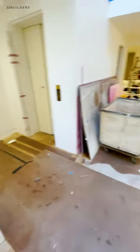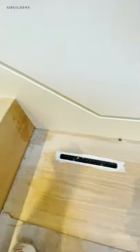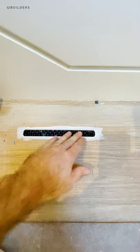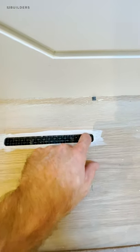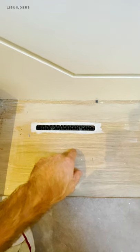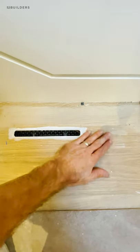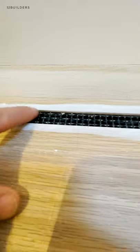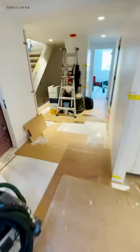Down on the first floor, we're going to do this area last, actually next week. We have these HVAC vents. If you guys remember way back when we did a site visit on it, these are actually metal grills, almost like automotive grills. We epoxied each and every board before the floor went in. This is the easy way where it's going with the grain. Tung's already white-stained these areas, so when he goes over with his buffer and stains the whole top, that leading edge — just a little eighth inch — is already done. This one here is done the hard way, actually perpendicular to the grain and throughout multiple boards, so a lot of coordination between us and the floor installer.